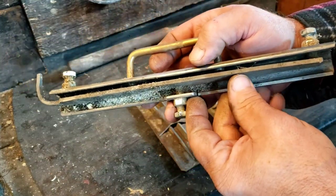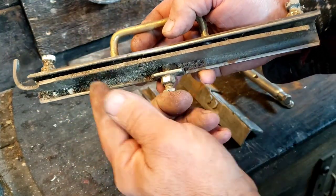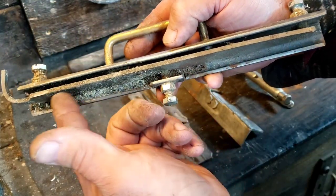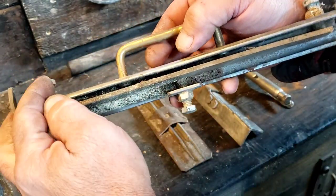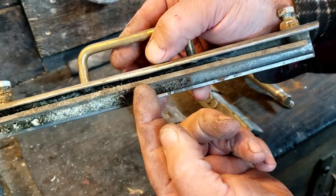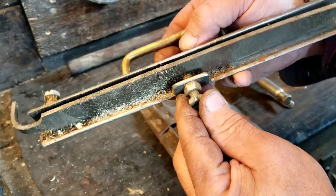All these I had to make myself. This is called a jointer. What it does is bend this file in order to match the curve of the saw — just by tightening or loosening these bolts, it applies pressure to the file and bends it.